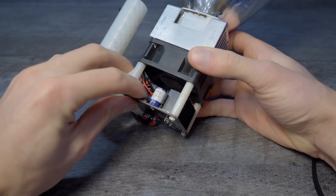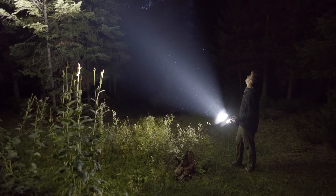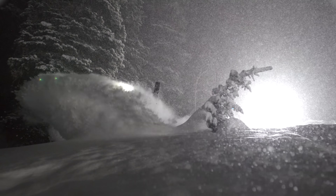Make sure all the wires are routed away from the fan blades. A LiPo battery can be attached to the back of the handle with Velcro. Just be sure to use a low voltage alarm to prevent over-discharge. We hope you're able to seamlessly integrate our 100W LED modules into your next high power lighting project.